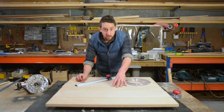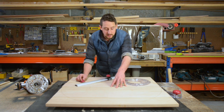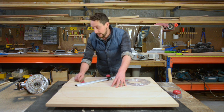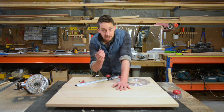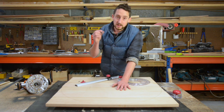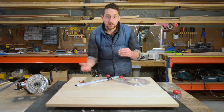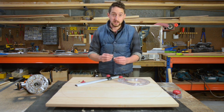I'm doing all of this from the bottom of the piece that I'm working on — in this case the Lazy Susan — because I don't want to have that little hole in the top when it's finished. That's also why I'm going to use the spiral up cut bit here, because it means the cleanest edge of my cut will actually be on the opposite side that I'm working, which when I flip it over will be the top side of this piece.